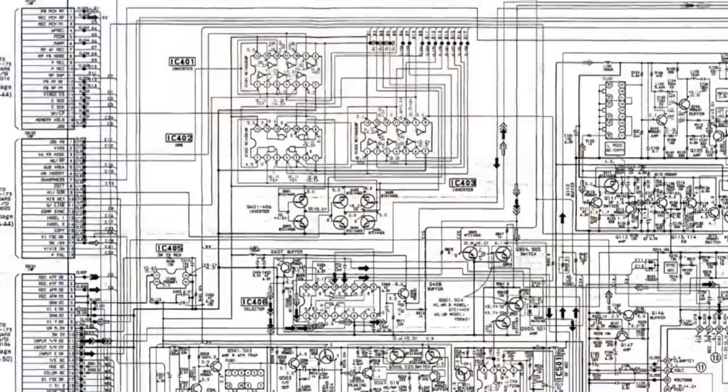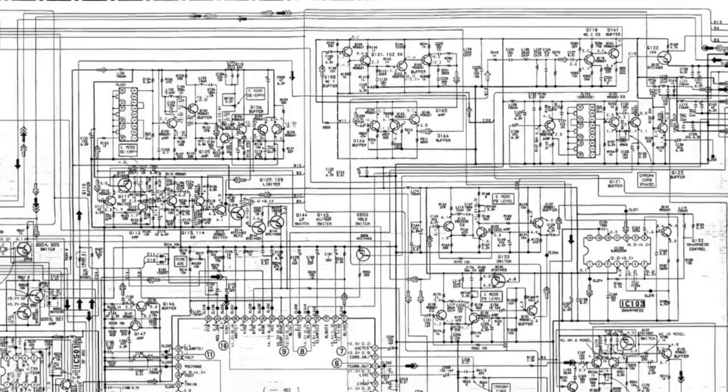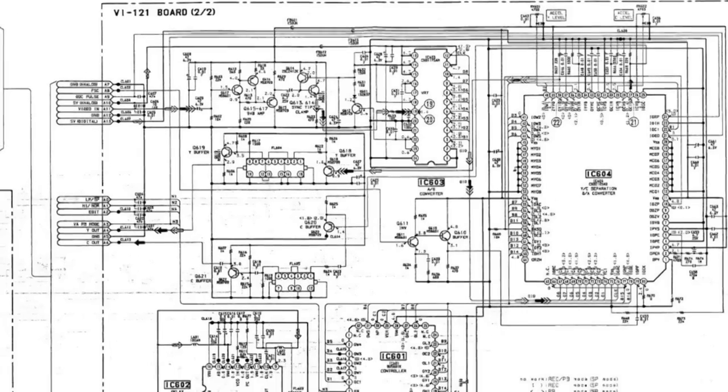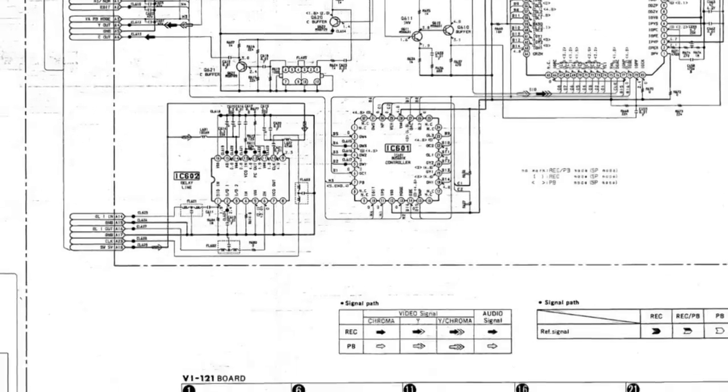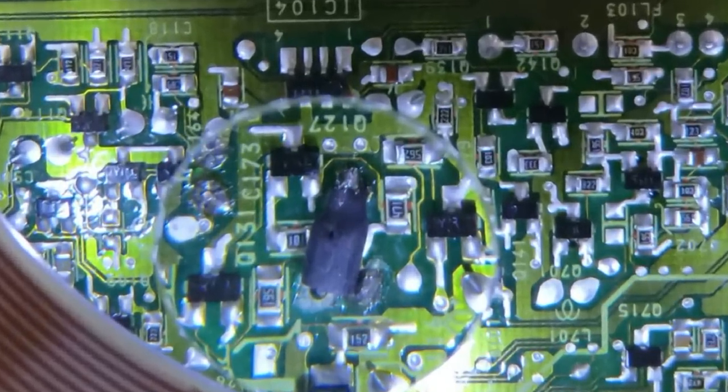I took the bad board, which has a terrible picture, up to the workshop to work on capacitor replacement. There are dozens of electrolytic capacitors on this board, and virtually all of them are out of spec. It's not practical to replace every single one of them. This would be too time consuming and risk board damage. The pads and tracks on this board are very thin. It's very hard to extract the defective capacitors without inflicting damage, and I've had to do some repairs because of pad damage. This makes the job very time consuming.